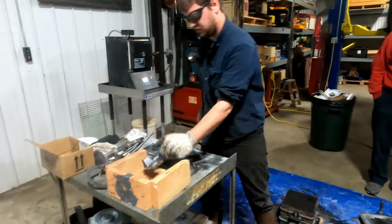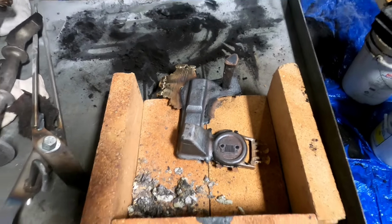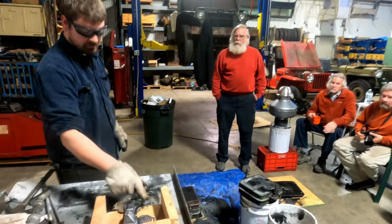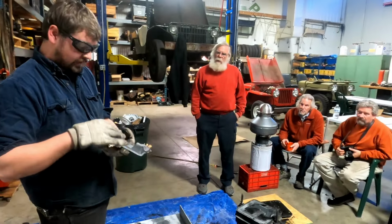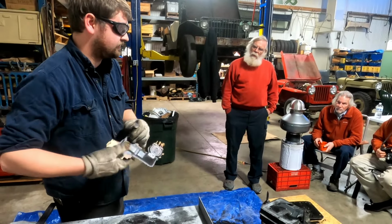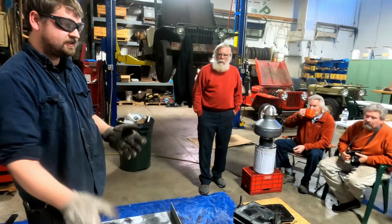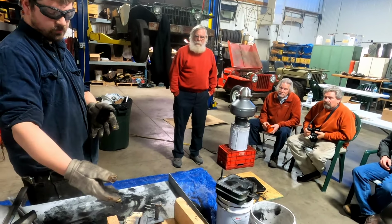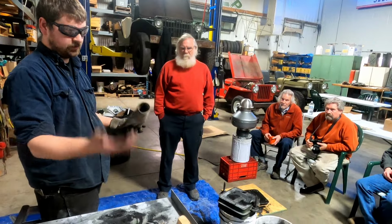So how much material here actually ended up in the buckle versus waste, not wasted, but excess? Great question. The gating, so it's yield, right? How efficient was I? Which is why I run a 6-on at home, because regardless, I always have to fill up this big bar, and also because you need enough distance, so if there's any impurities, which you can actually see in this one, you see all these little pits on top? That's all slag and things. So if you run a long enough bar, which is actually why I have this little trap right here, you'll get that to settle out before it gets into your part, which is what I want. I don't want that in my part. If I wanted to do a really crappy one, I'd just go right from the sprue to the part and be done, but I'd get all these impurities in my part and it would look like garbage.